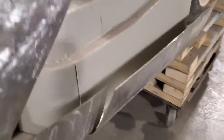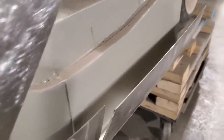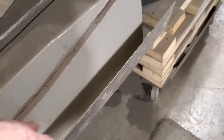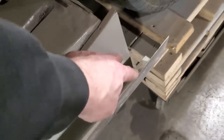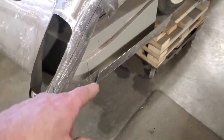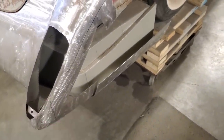That's just the first fit. You can see now it's got to be rolled in a bit more on the back than on the front. The front seems to be nice. You can almost look at the shadow here, and you can see that it's wider back here than it is up here. I like to have that consistent. So I got to go over on the pipe anvil now and put a bit more of a curvature in the bottom of that.